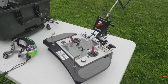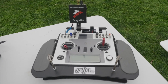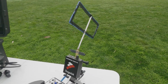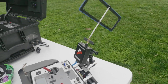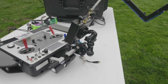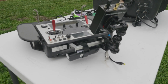For the transmitter I'm using the Taranis X9E — that's the tray version of the popular X9D. I have extended stick ends on here and I've made some customizations to it. In addition to the X9E, I have the DragonLink V3 Advanced full-size. I have a notch filter and the ImmersionRC CrazyMoxon 433 megahertz antenna on the back. A 2200mAh 3-cell battery is powering it. In the upper right corner I have a push button to activate head tracking if I were to connect head tracking to it.